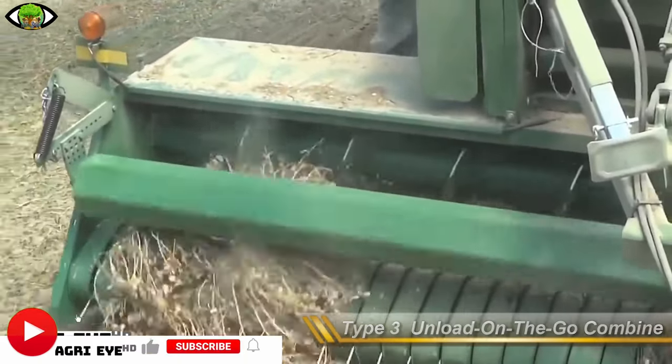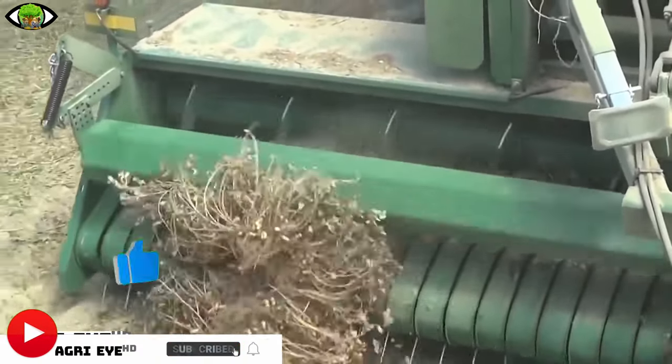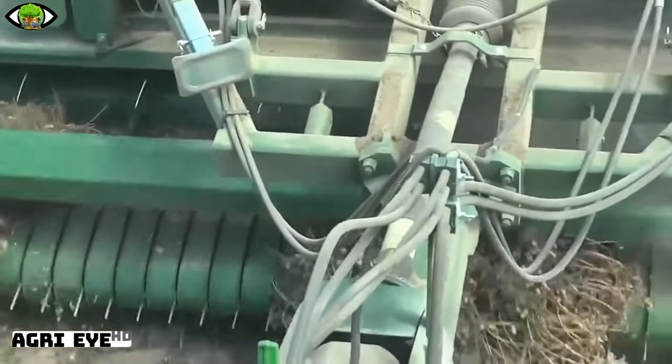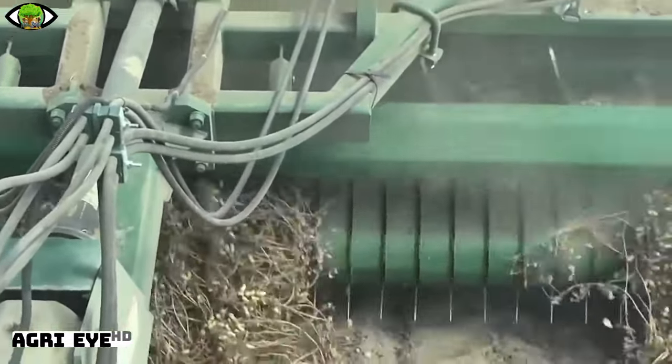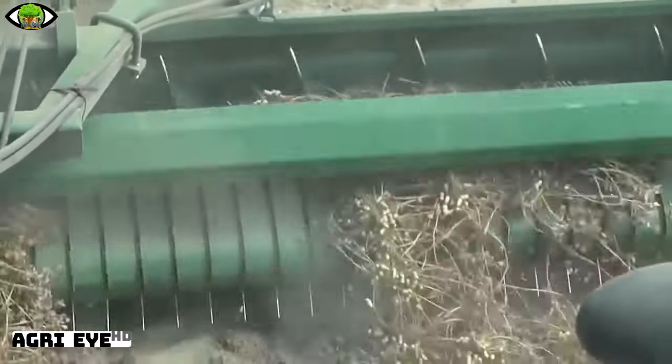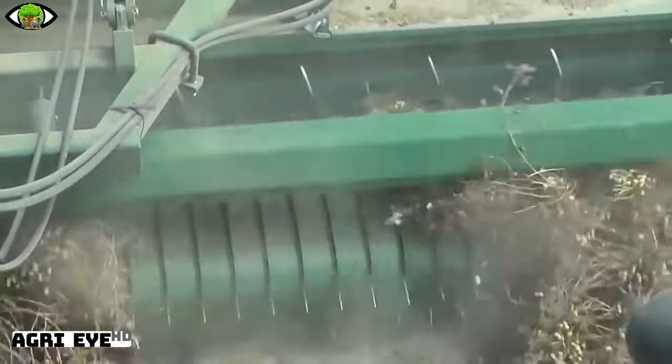Adjustable strippers provide efficient threshing. Separation screen in combination with adjustable airflow provides for efficient separation and reduces losses in various harvesting conditions. Double swivel gearbox allows sharp turns, which improves harvesting efficiency. Large single wheels provide good flotation.